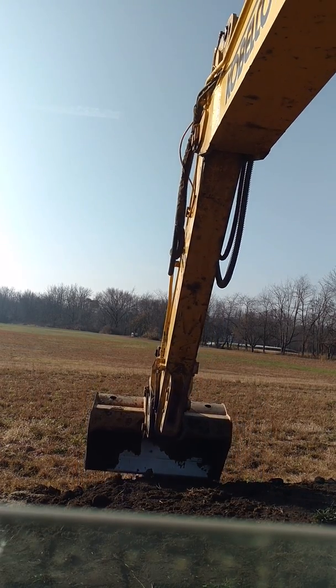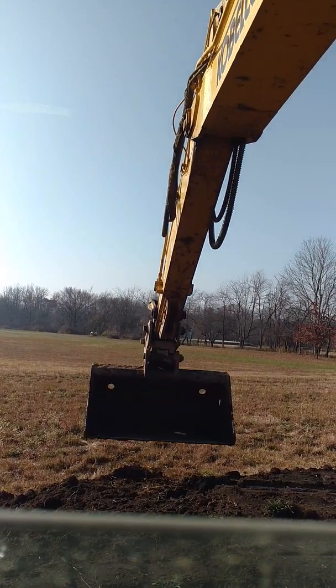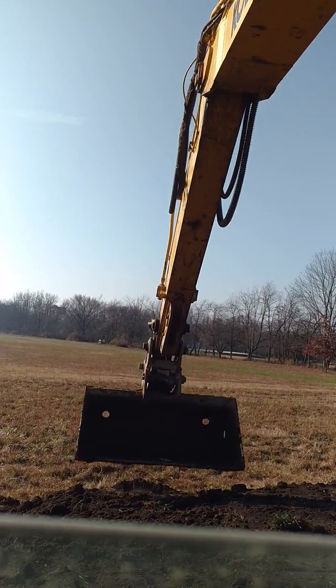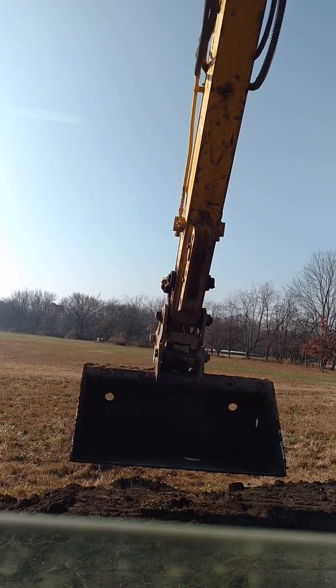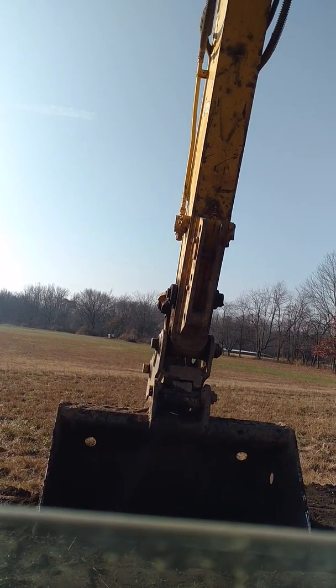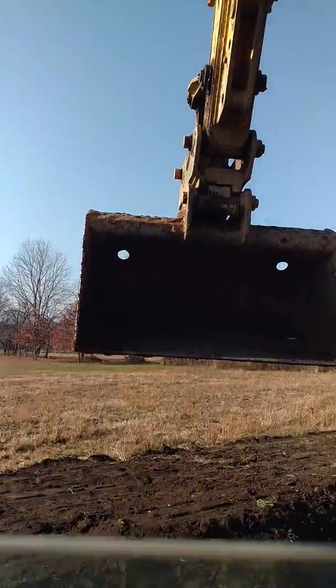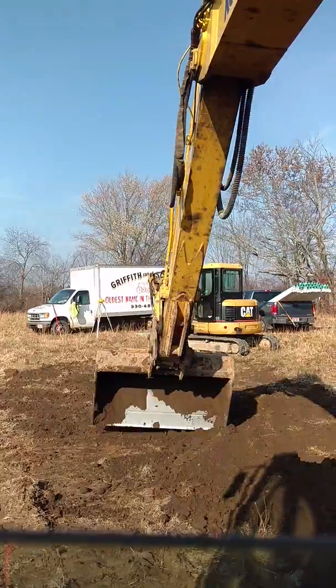At the bottom, you always want to make sure you get your topsoil at a minimum of a foot past the end of that sand as a minimum. That way it helps kind of make a little barrier so that in springtime, if it's really getting a lot of rain and this mound is really saturated, it won't blow out as bad.